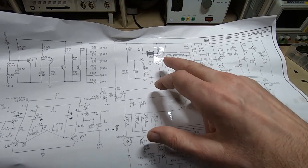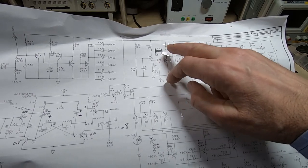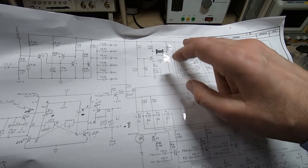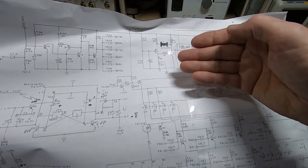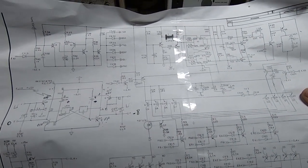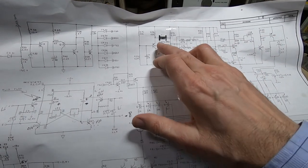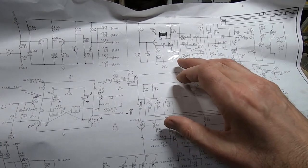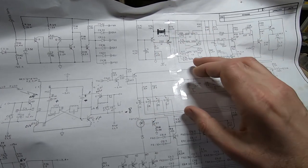That's why I was using state mode — if it's a timing issue and you're using sampling or timing mode you can miss the problem, but in state mode looking at the correct clock you're really seeing what the machine sees, giving you a far better chance of catching something timing-related. As I said, if I went above about two megahertz the problem would manifest itself now and again; if I went up to about 3.8 megahertz it wouldn't work at all.